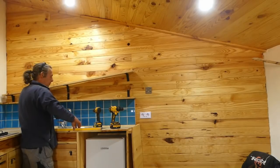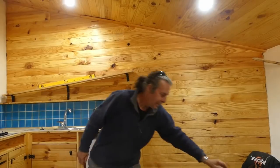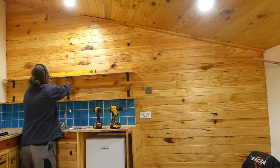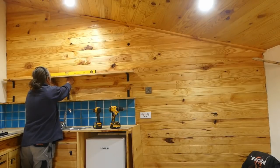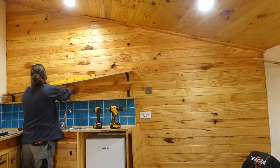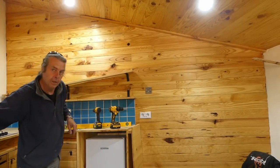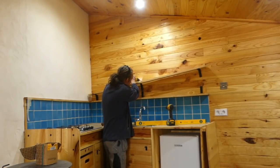If that makes sense. So we've got the spirit level on it. Where's me awl? And we just lift him up until he's level, which looks like about there, maybe another millimetre. There. Make our indentation. I'm going to put the screw in first, just to make it easy for it to go in.